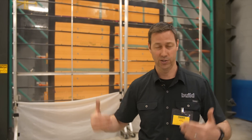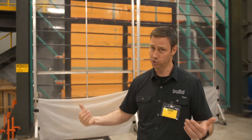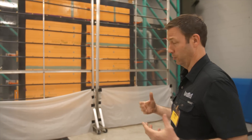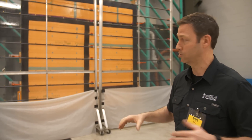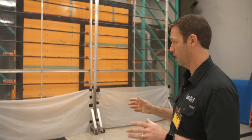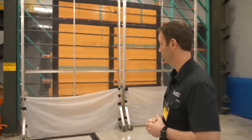Code requires two hours on this spray rack at about a 20-mile-an-hour wind. Having this facility and being able to test this SE430 system all the way to failure means you can verify that your air barrier — which is your waterproofing as well — is going to be at least as good, if not better, than your curtain wall system. Curtain wall is your window system and facade on a commercial building. This is really impressive, and it doesn't cost them anything to do, so they can set up all kinds of systems — a big differentiator compared to manufacturers without an in-house test facility.